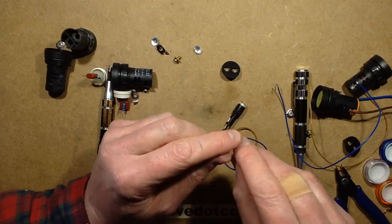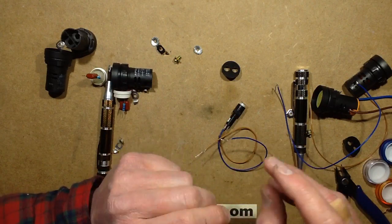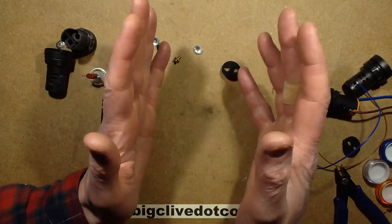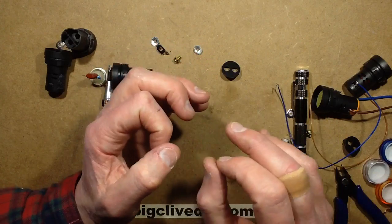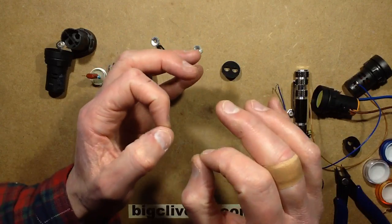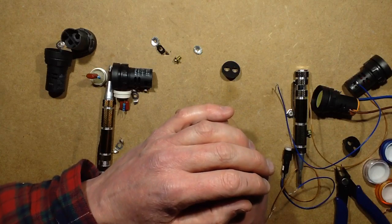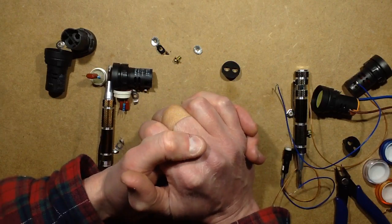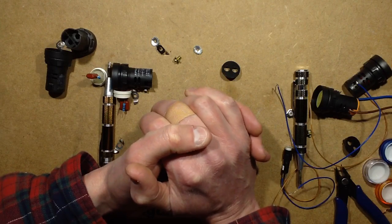Okay, no problem. I insulated the wires up, took the box off the wall and tucked everything in so it was just ready to be covered, and then the wires brought through again. Then I went on to the next box and I took it off, just carefully tested, same indicator, same boiler thing, 12 volts AC. So that's fine. Took off the third box and just thought, no need to test this because it'll be 12 volts, and it was 240 volts, and it gave me quite a shock because you just get complacent.